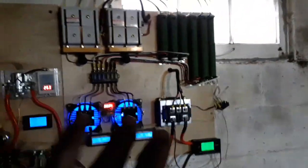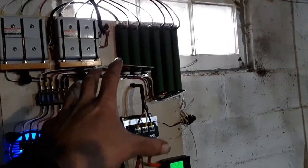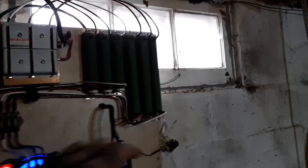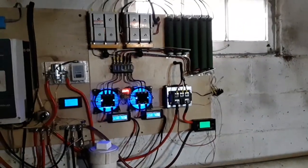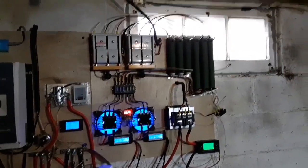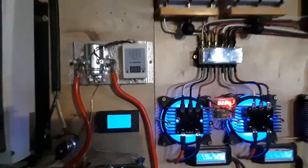Instead of grounding out the stator and trying to stop it, the resistors slow it down and they start to heat up instead of heating up the stator and burning your stator out. That will destroy a turbine if you try to brake in wind. So not only does this protect your batteries, hey, look at that. We just engaged.